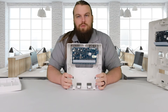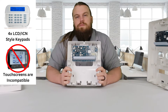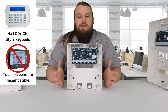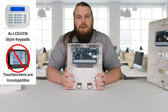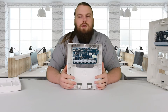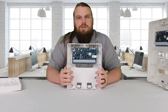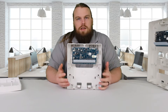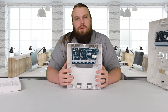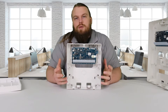With these modules you are allowed to add up to four wired DSC Neo keypads — you can use the LCD keypads or the icon keypads. When you do use keypads with this, they don't come with full functionality; they are limited to pretty much arming and disarming only, with a few other small user functions. Personally, all of that is a lot easier to do on the IQ system itself, so I'd recommend just using hardwired keypads for arming and disarming in different locations.